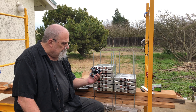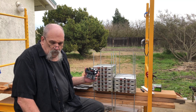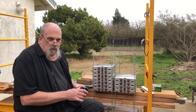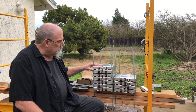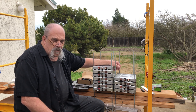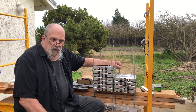What I did is I used a bulk charger, put these batteries in parallel with each other and charged them all the way up to about 7.8 volts. Then I disconnected and hooked up my buck converter. With my power supply I was able to buck that down to a lower voltage so it'll charge. I charged at 12 amps until the amperage was down to zero, it was just about 8.3 volts, then it went into constant voltage and the current dropped down to zero. I did that with both stacks and now I need to put them all together and hook up the inverter.